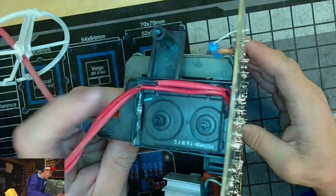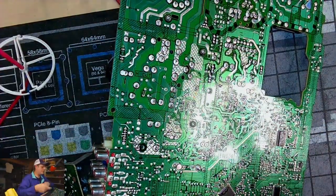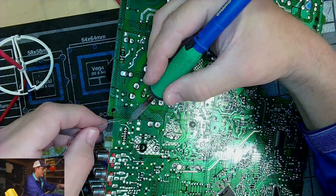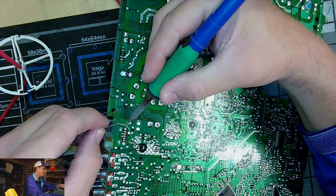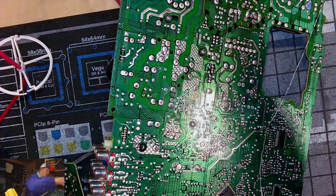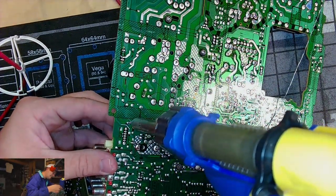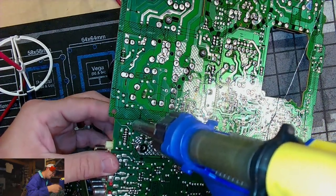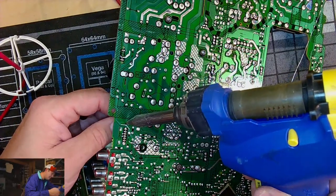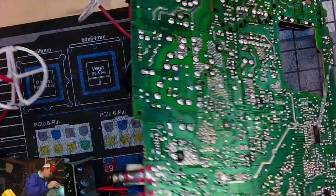Fresh flux? I don't know. I mean, fresh fluxing, I don't know what you would mean by doing that. You could add flux to it and then just reflow the regular solder, I guess. But the problem here is just the chemistry on this old lead-free solder, which I completely think is just gross. But adding the fresh solder, that always makes it easier when you're removing capacitors.